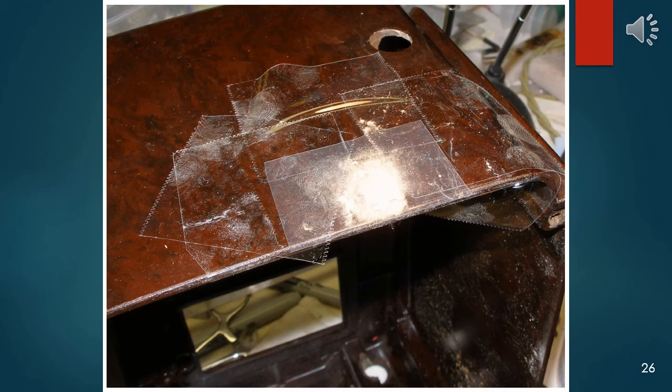After the resin is cured, I can sand it level and begin to blend the patch into the good Bakelite. When doing the initial wet sanding, I protect the surrounding Bakelite with the thinnest version of packing tape I have. This makes it possible to come very close to level without scuffing good cabinet surface.